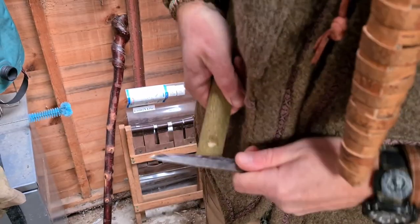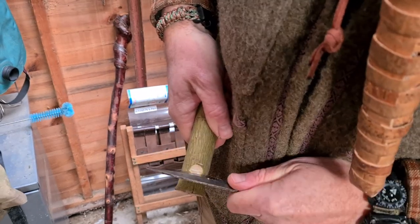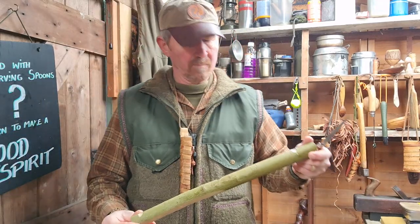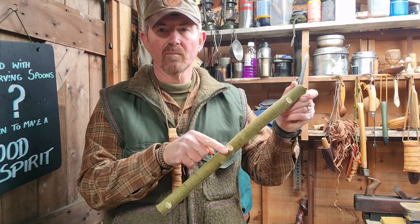Now, still on those two pieces of wood, you're then going to turn that over. And at the bottom edge that you've just split, about, again, a thumb tip to a thumb knuckle up, put in a little V cut. Then do another one in the center, and then do one at the top again, from the tip of your thumb to the first joint down.